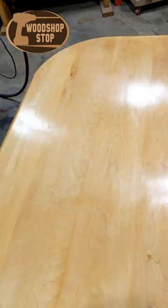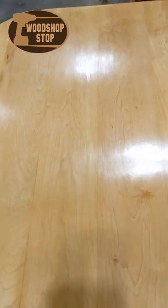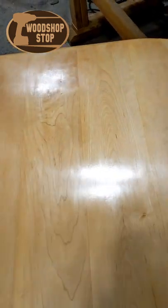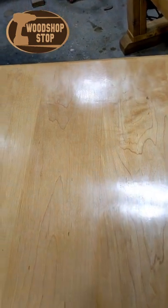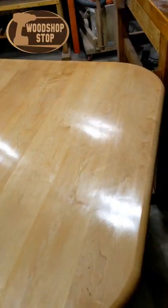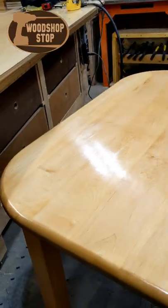I got the majority of the scratches out. I sanded it down with my old Craftsman belt sander, re-polyurethaned it with some oil-based polyurethane, and then went over it with some wax — kind of waxed it up a little bit with a buffer. It's not exactly perfect, but it's a lot better than it was.